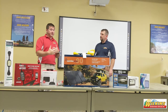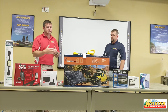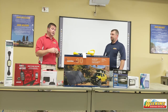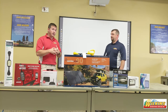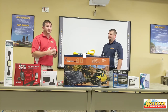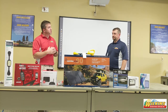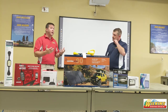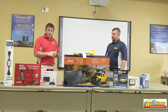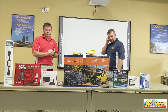When a 12-volt battery is charged nonstop and consistently plugged in, I've had a customer experience a 50% water loss in just two months from being plugged in nonstop. So keep an eye on that — maintenance is very important. The 12-volt battery system is a major part of your RV.